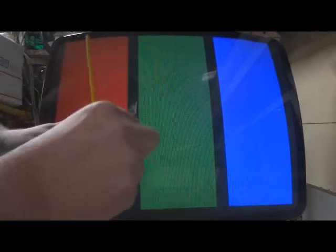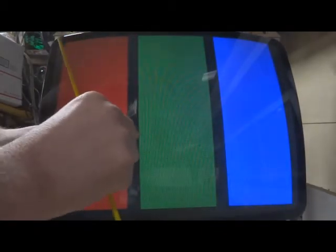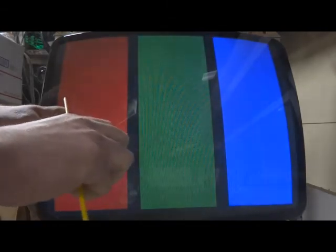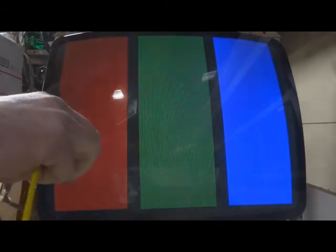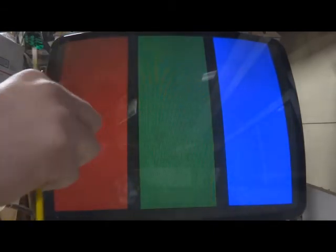So what we're going to do, before you start, is basically take your remote board and set your contrast to its mechanical center and your brightness, same thing, to its mechanical center. You can see on these chassis, if you don't have them adjusted quite right, the brightness doesn't do a whole lot, and that's part of the design. It kind of sucks, actually.